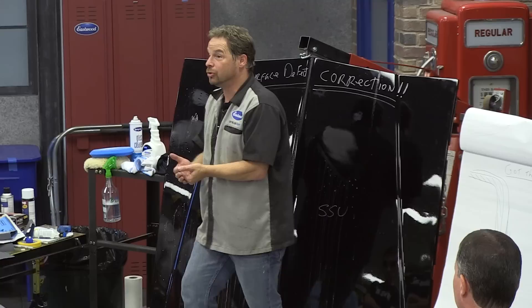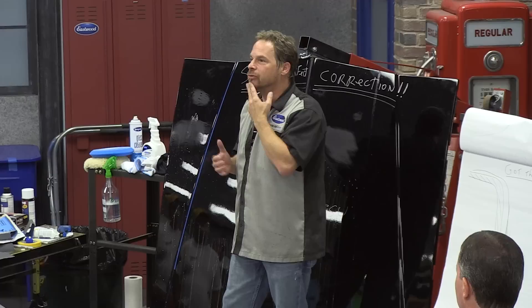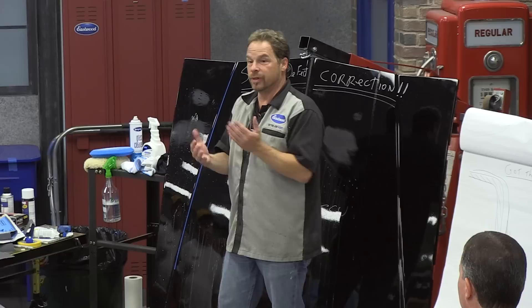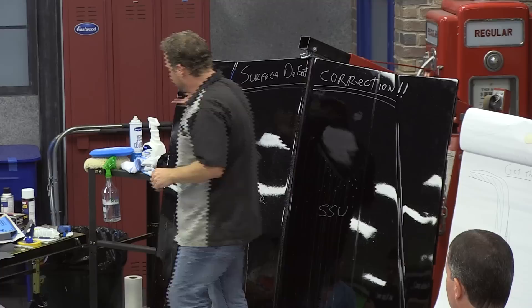Those techniques kind of stick with me. So, where are we going next? We've done run razor technique. His question was, after scraping the runs, can you just go right at it with compound or do you have to sand it? You have to sand it — because even though you've got a finely tuned edge on your razor blade, it's still not perfect. It's not 2000 grit. I land at 2000 grit and above for gloss. You've got to follow through with your steps — correcting the surface to where you've got an even playing field for gloss, then bring it back up to full gloss.